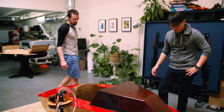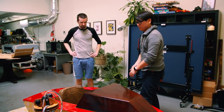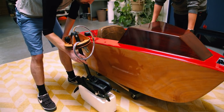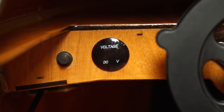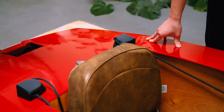It's a beautiful finish. You've taken this out on the water — tell me about the drive system. It's propelled by a basic trolling motor, which boaters use for fishing. It runs off a 12-volt battery; it's an outboard motor that clamps onto the back, and you run your power cable through a connector. You place your batteries right back here and connect them with alligator clips — and that's your drivetrain all set up.